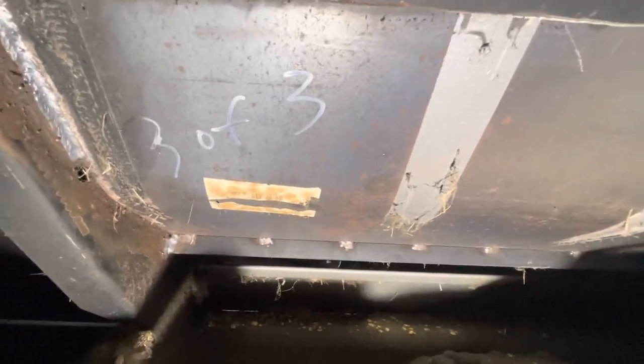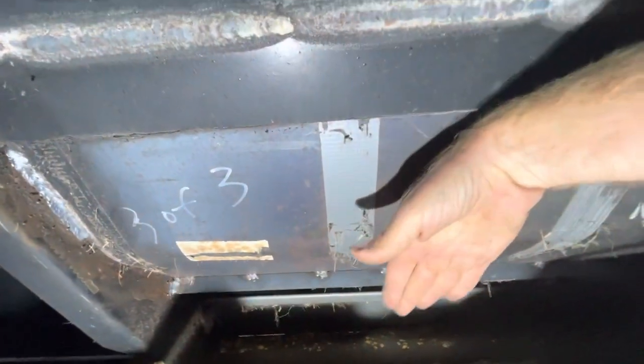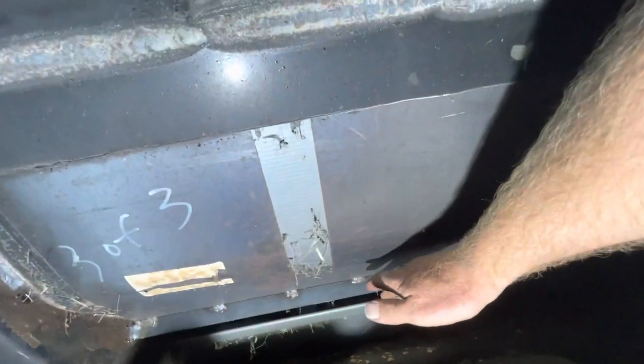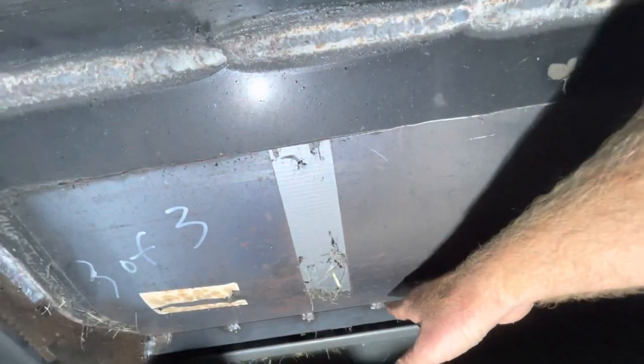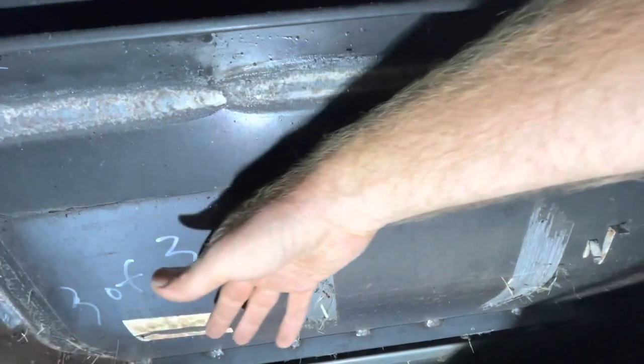Okay, you can see the new floor that we put in, and how it simply comes in, then angles and goes straight up over top of my head, up to the rotor. Whereas with the old floor from the factory, there was a hump right here that caused a choke point right beneath the front drum of the upper feeder house chain.